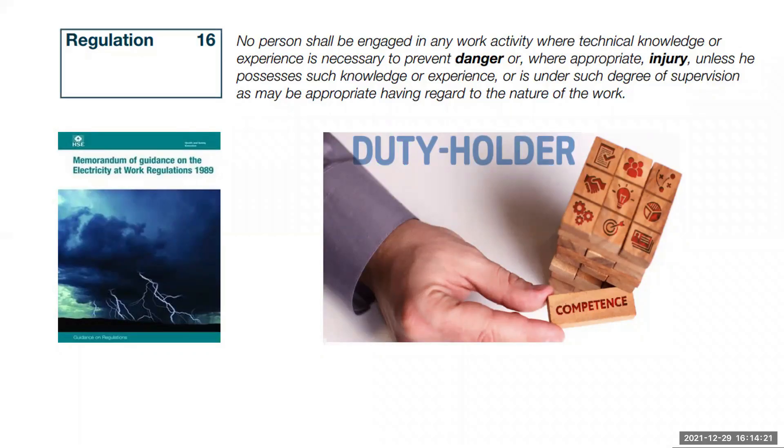Your employer could argue that you don't need a safe isolation kit because they are in charge of the installation. And while that may be true, they still have obligations under the Electricity at Work Regulations and still need to perform safe isolation for any circuit that is being worked on — even more so for persons under their supervision, as they are the duty holder and it would not look favorably in court if they failed in that duty.